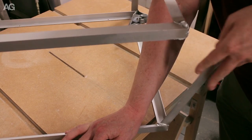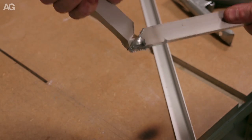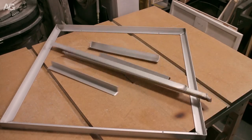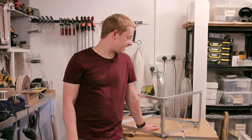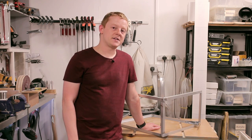Unlike welds, which give you a proper chemical bond between the two materials, brazing is just like solder, putting it on the top, and it doesn't really get in or penetrate into the material and can just break off, unfortunately. So I think this method is ruled out for the application I wanted it for.